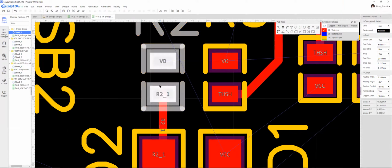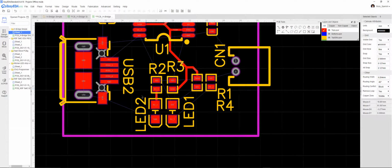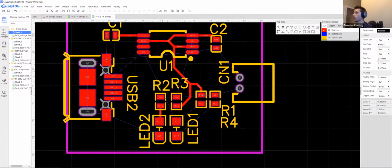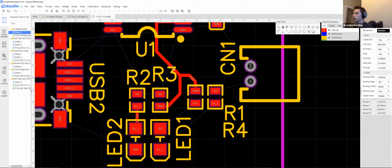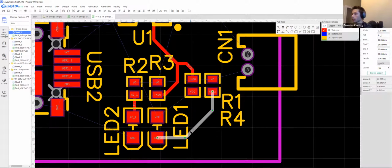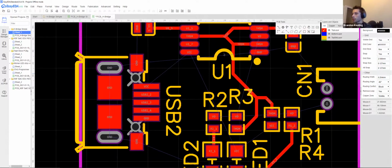This is a limiting resistor. I was concerned that there are a lot of crossovers, right? Exactly, and that's exactly what we want to try to avoid. So initially, I'm getting everything out of the way that is not VCC or ground. Those are the only connections that I'm going to do right now, because VCC and ground will take all of 2 seconds to connect. Actually, that looks like about the last net.